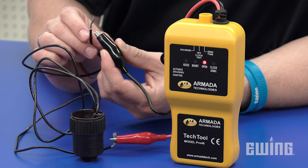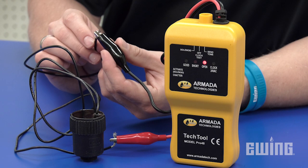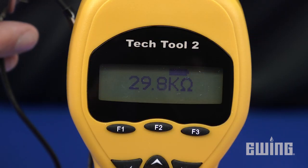On the other side of the spectrum, the Toro SpikeGuard solenoid, designed to survive lightning strikes, has a resistance of 30,000 ohms. Since the Pro 48 would indicate any reading over 60 ohms as an open line, it would not give you an accurate result in this scenario. The Pro 50 will display the solenoid's actual resistance, again allowing you to make the call.